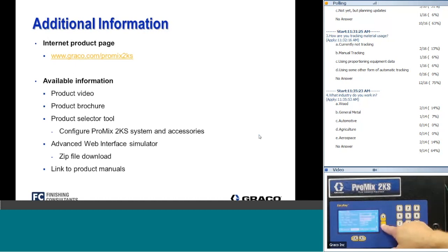The calibration screen allows you to do a manual dispense — the system tracks how much material was dispensed and you compare it to what's measured in a graduated cylinder to verify the meter is working properly. We connect air to the system and then Bill will walk us through a load and a color change.